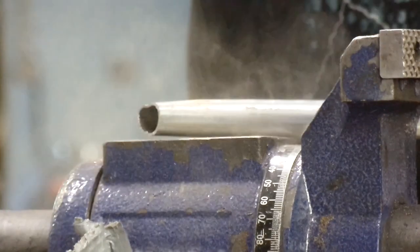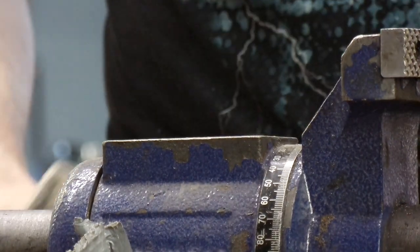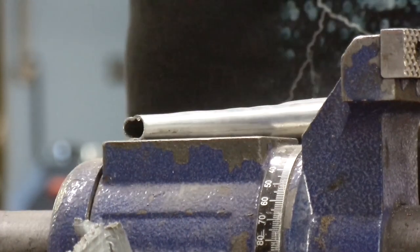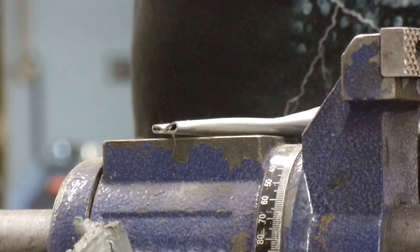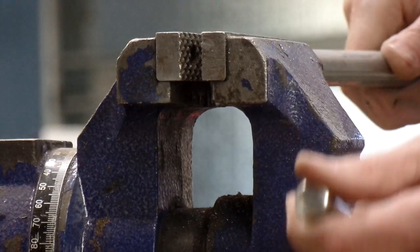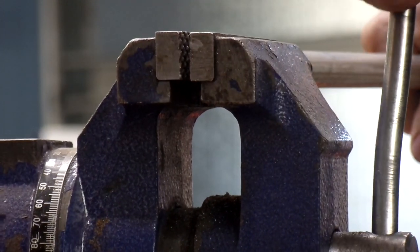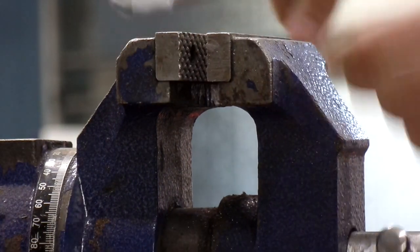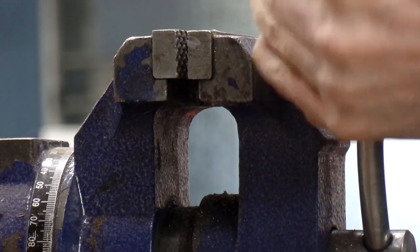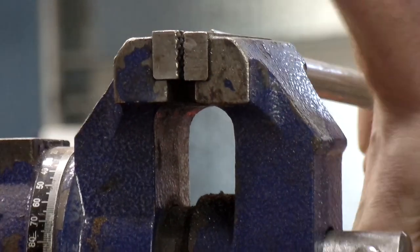The length is something of a compromise. I just used a chunk of EMT and I'm flattening it down so I can drill two pin holes in the ends. The same quarter-inch bolts that go through the linear actuators will go through this. It does look awful after I hammered it, so I tried to clean it up a little bit, but they still didn't look terribly good. Honestly, this thing is designed to be functional — I'm not sure how many uses I'm going to get out of it, so I'm not taking a whole lot of care in fabricating it. It would probably be made of steel if I really wanted it to resist bending.